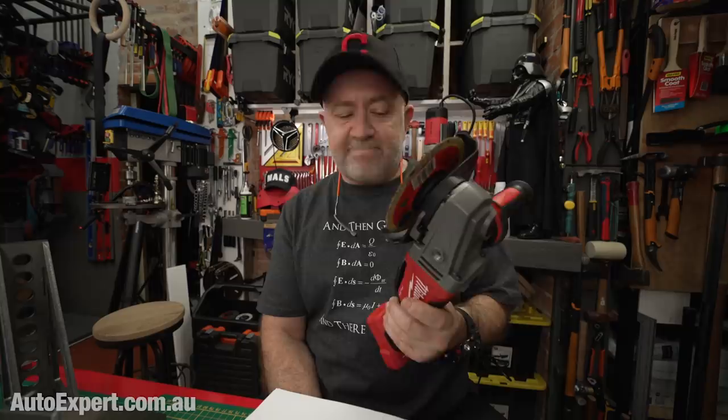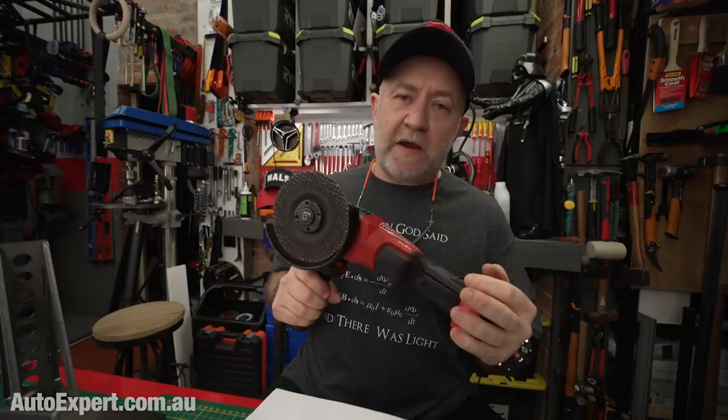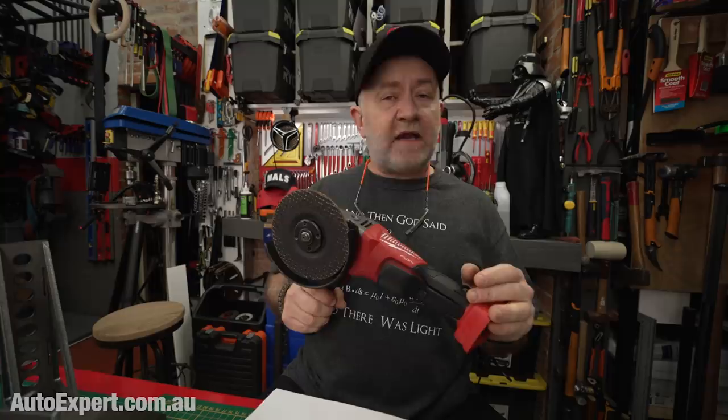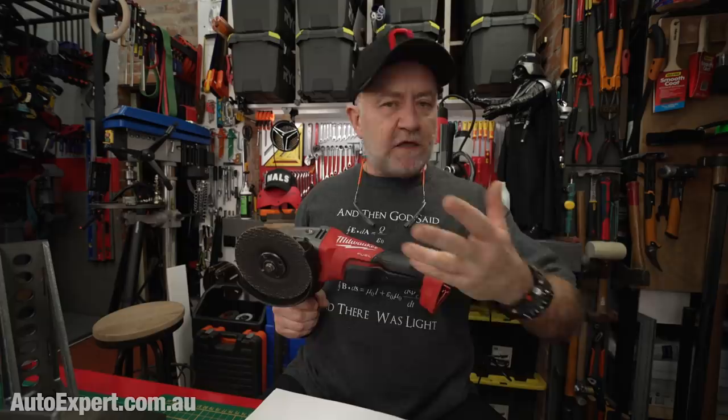I just don't want that, so my position has not changed. Plenty of places have arbitrary safety policies that say wear gloves, and I'd be happy to debate that with any safety officer ever, because wearing gloves with grinders is an entanglement and entrapment hazard. It's kind of up to you how you manage safety in your own workshop, but I will not be wearing gloves ever when I touch an angle grinder. If you're welding and you switch to grinding, you've got to take off your big heavy welding gloves. I console myself by still having 10 fingers after 30-something years of touching the tool.